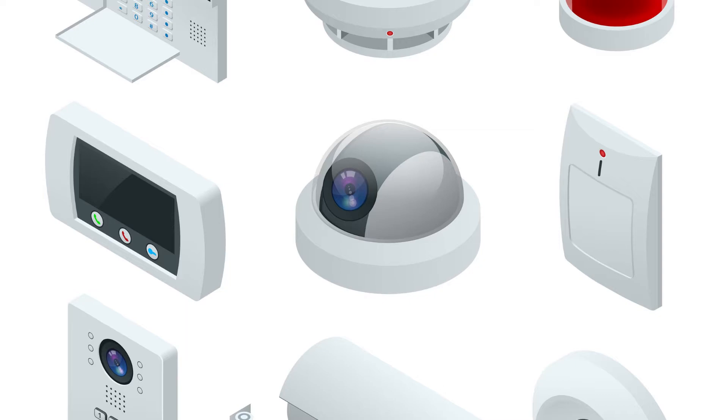Shock Sensors. Shock sensors provide early detection by sensing vibrations and any sudden forceful impact on a window or door. They detect the shock waves associated with breaking glass or forced pounding to break down a door. A shock sensor can be installed on a window, stationary glass opening, and a sliding door, where you would not anticipate someone to knock.